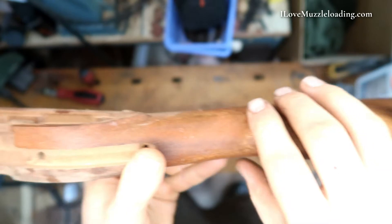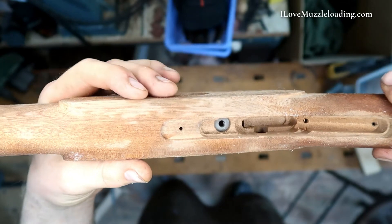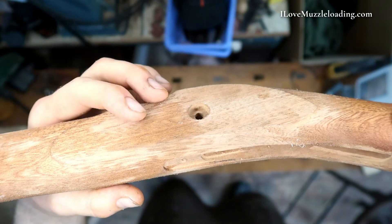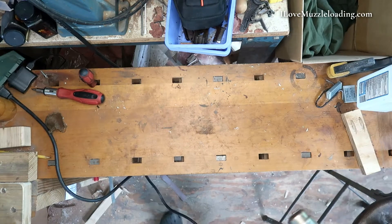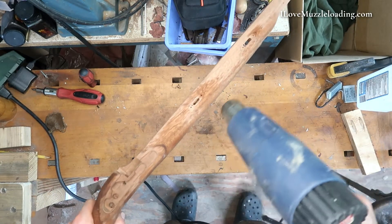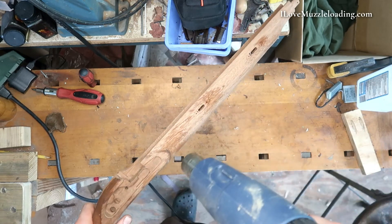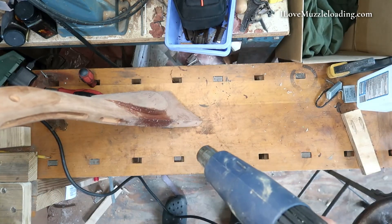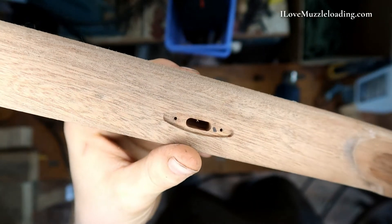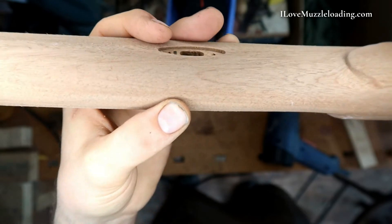You can see a little bit of that texture in there. Here's some of the areas where it's already dried out. It might look like or sound like some of those are paper towel fuzzies, but there's a lot of that wood end grain in there. Now with my heat gun, I'll just accelerate this drying out a little bit. And there you can see all those whiskers that we're able to pull up with just that short and quick process.